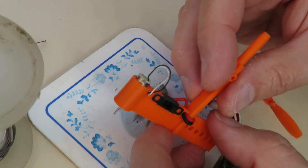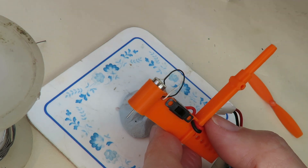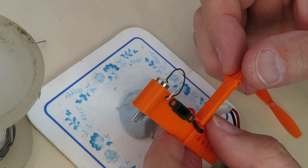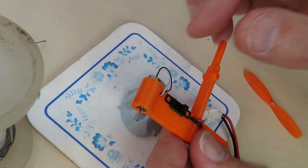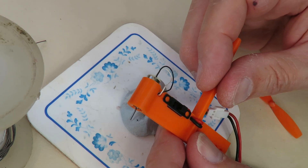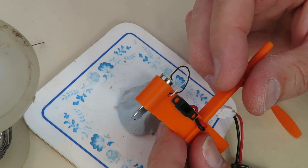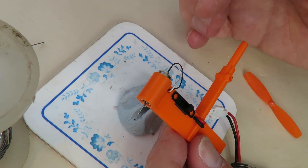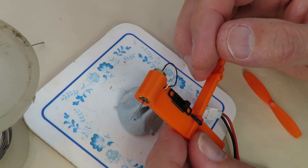I think my method of just drilling into the existing hole, stripping the wire off, pushing it through and re-soldering it was far better than trying to get the old brush out and soldering onto the brush separately - because I've really messed up the brushes in there by doing that. So if I have to work on another one, I'll try that method instead: drill the hole out, tin the wire, push it through and re-solder it - if there's enough space.